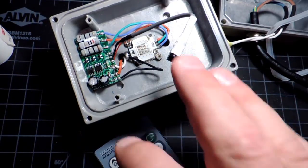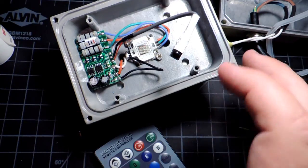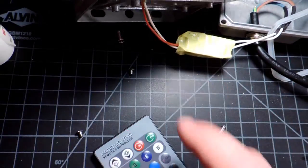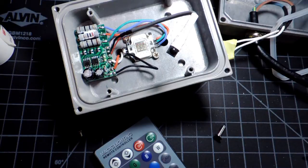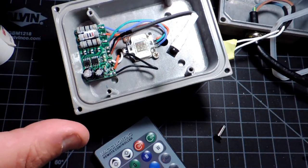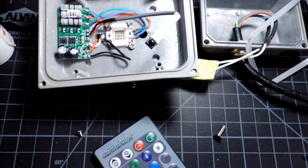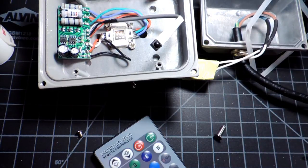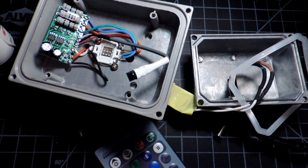My next step was going to be to get a solar cell out and measure the light output from the LEDs and get a sense of how they're doing the pulse width modulation, but I'm not going to do that — I'll keep this a short video. This is more of a cautionary tale than a design teardown. The errors with the electrical wiring, the use of sharp edges without proper wiring, the load resistors getting extraordinarily hot — these are things you have to really worry about when people privately import goods from China without the right safety markings. If you actually put this into service, it wouldn't be a really good idea. I was just attracted by the price, and I guess that's the truth of most things in life. This will be hitting my spare parts bin — I'm certainly not going to plug this one in my house.